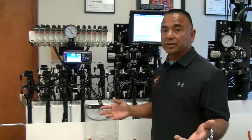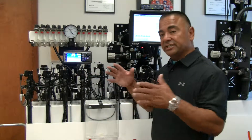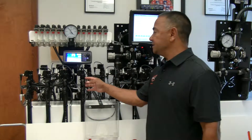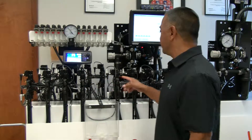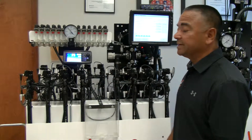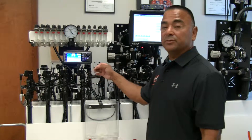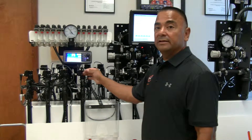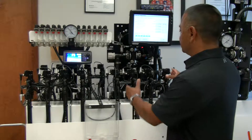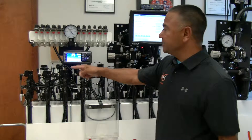The GX30i VRT will allow you to do up to 32 different sections. No rate controller today can do that — the Trimble can do up to 12, but this will section it off up to 32 different sections. It uses a harness on each one, utilizing CANBUS to assign an address to each valve, then LIN bus protocol for the module to manage each individual valve. We're not having to run these valves back to a central harness — CANBUS assigns the address to each one.